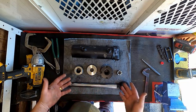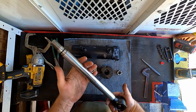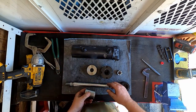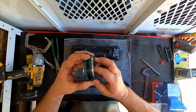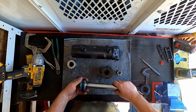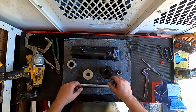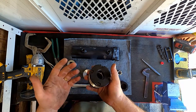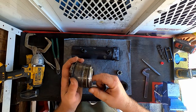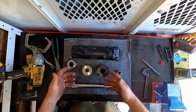So this is a cylinder completely broken down. We've got the barrel end — that's the part with the cracked weld. This would be considered the rod, which just has a chrome finish on it to keep it from rusting. This is just a spacer to keep the mast from tilting too far forward — it floats in there and does nothing aside from being a spacer. This would be your piston — it goes on the end. Hydraulic oil pushes on one side and pushes the rod one way, and when it pushes on the other side it pushes the rod the other way. That's where the two hydraulic lines hook up. This is your gland end, and nine times out of ten this is why you're looking at one of these cylinders — because this is where they leak. We'll talk about the seals as we pull them out.